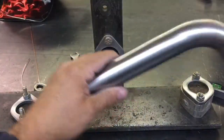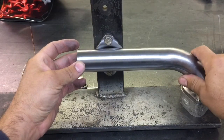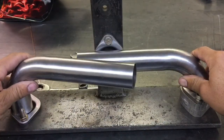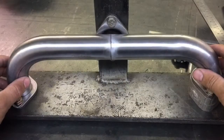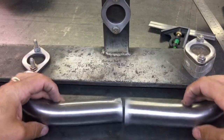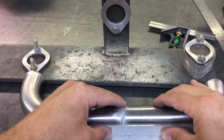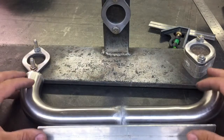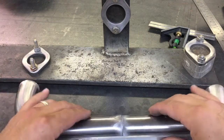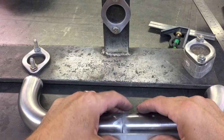I've got these cut to this length where they sit level and they're centered up in this flange here. Now I have to cut my length to meet in the center. I've got everything cut and it's ready to tack together and start welding. What I do first is just clamp a straight edge on there and get a few tacks on before I put it on my fixture, to make sure it's straight instead of having a bow in it one way or the other. I can clamp it, get it tacked together, make sure everything's flush, and get a nice tight fit.